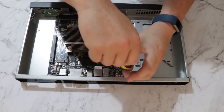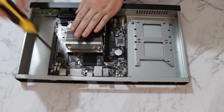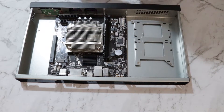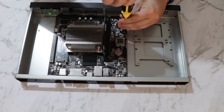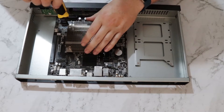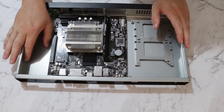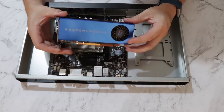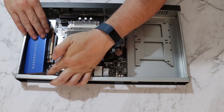Let's pop the board in — just four screws since it's a derivative of mini-ITX. I won't screw these down too hard because in a 1U server case the standoffs are significantly shorter than a standard PC case, so the board does end up flexing a bit on the CPU backplate and other mounting points. The card I'll be using is a Radeon Pro WX 2100 from my previous system — it's going unused right now, so we'll pop it in here.